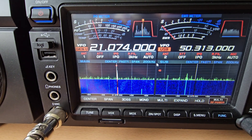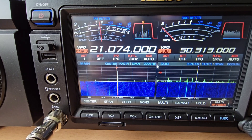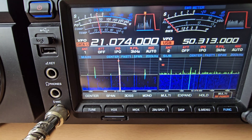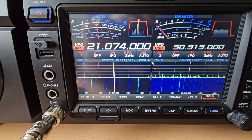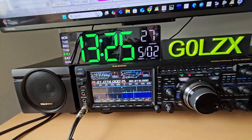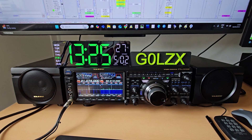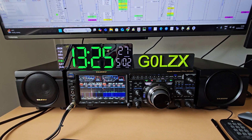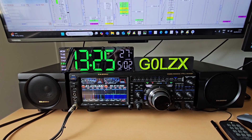Once again when the signal pops back up, you've got S9 on the long wire and a similar signal on the loop, but the noise level is drastically dropped. So if you're looking for an antenna upgrade and you're suffering from any sort of noise, I would definitely suggest a loop antenna — I'm sure it'll help you out. 73 from Ricky, G7MLX.